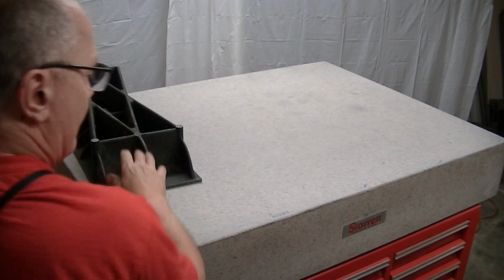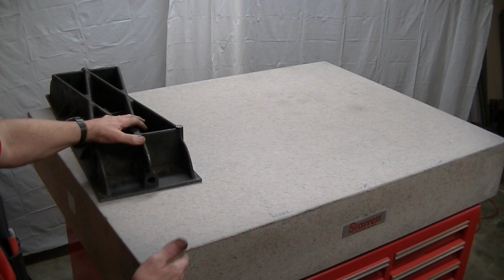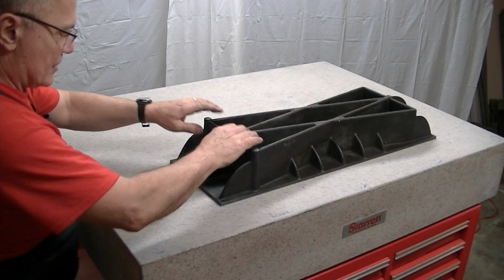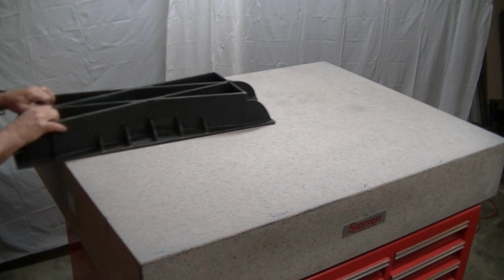As with all things, scraping, lapping, you're not just going through the motions. You have to be thinking about the mechanics of what's going on. As you saw here, I needed to assess the curvature of the plate to change my technique. I think as much as that was out, I can do another lap here. Now, just for the fun of it, let's see what we're still hinging in the center, which is good. That means we've got room to move here. So I'm actually going to do a cast like this. This end, do the same thing.